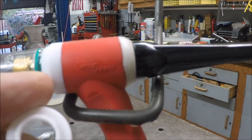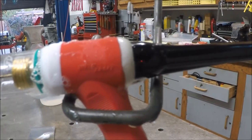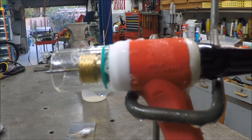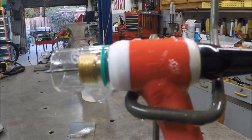I've changed from this stepped piece that's flat to this other front piece that has a bevel. Let's see if that solves the problem — we'll give it a little spritz again. I tighten the back cap a little bit and that helped, but as you can see we're still leaking quite a bit of argon. Let me turn the argon back down so we don't have so much pressure and see what we get.